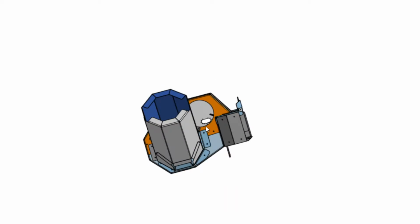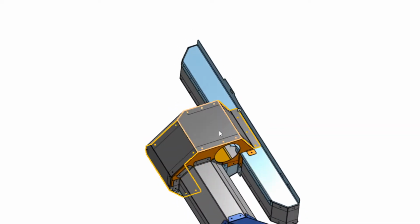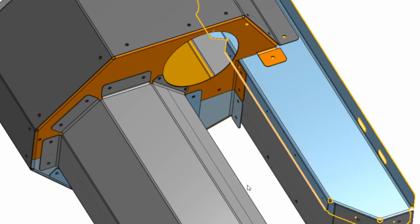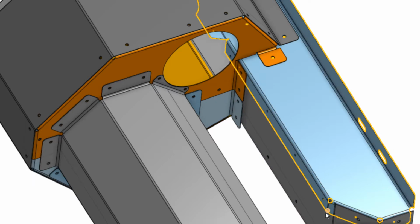Then you're going to need to transition perhaps to the aluminum tube. That may require a little bit of custom work in this case. If I had them on hand, I would send you a straight rubber coupling that would go onto the aluminum on one end and onto the galvanized fitting on the other. I don't have any of those around, or you could do it that way. If you have an extra rubber fitting, you could even cut a little bit of the straight section off at each end of that and use that straight section as a coupling to join the galvanized HVAC fitting to the aluminum tube that we send along with the kit.